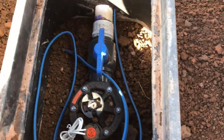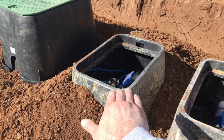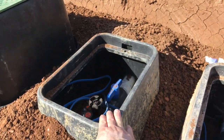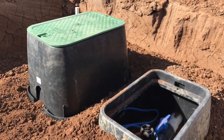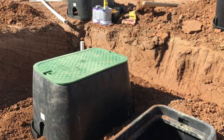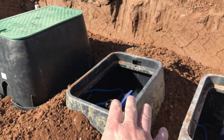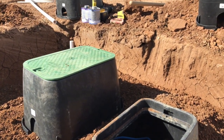That's the first reason why I like to do this. The second reason is — you can see there's already one here, there's the top of that one — when you fill it up, I can adjust this box up or down however I need to, to get it level with my dirt. If you use an extension, your extension sits right on top of the valve box, so if you don't get the bottom one right, your top's not going to be right. This way, the top box actually slides over the top of this, and I have flexibility to go up and down. So if some of this settles and these go down, I can dig this valve box up and raise it to be back level with the top of the ground. There are two reasons why I like to use two valve boxes: one is to keep all the dirt out from around the valve itself, and two, to give me flexibility to make sure the top is even with where the grass is going to be.